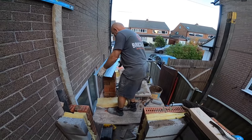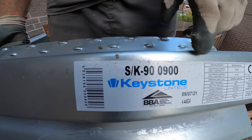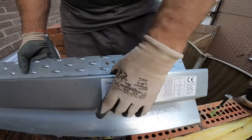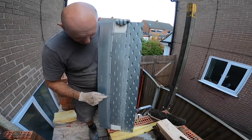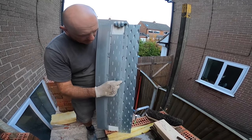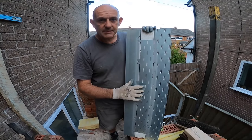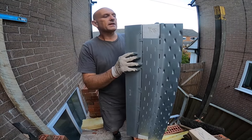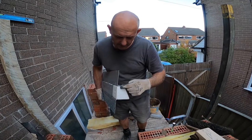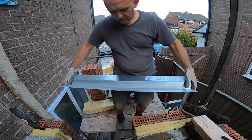Today we're using Keystone SK90 — 90 for 90mm, for a 100mm cavity. We're still on 100mm cavities up north. This is a thermal brake plate. What this does is it's only attached by little welds at strategic points, so it's not solid. Because it's not fixed solid, it reduces thermal bridging by 90%. And what it actually achieves is it turns the lintel from a C section into a box section, by fixing it at the bottom, which will stop it twisting.